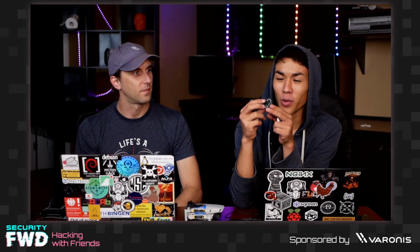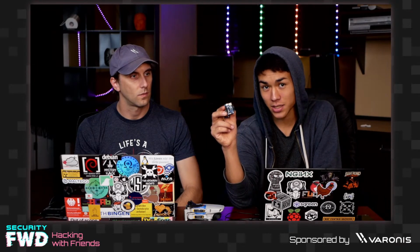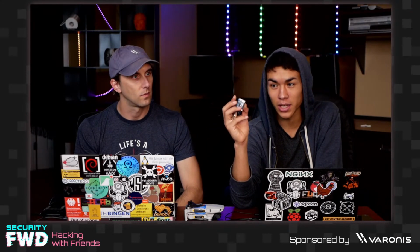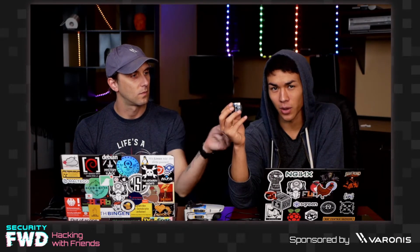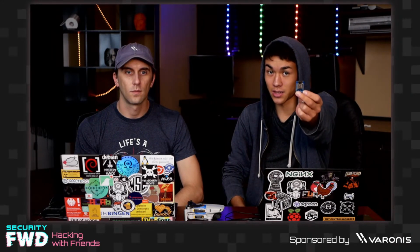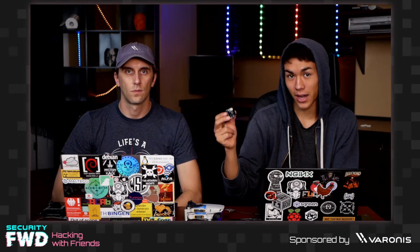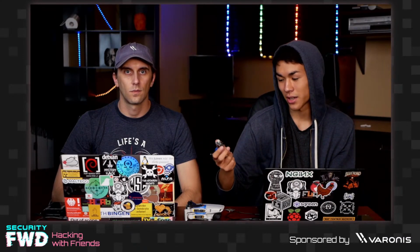So the main board setup we have here is a bunch of D1 Mini hats stacked together. So if you're not familiar with the D1 Mini, it's basically a form factor for the ESP8266 that looks like this. And it comes with hardware modules that you can just stack on top called hats, which is short for hardware attached on top.